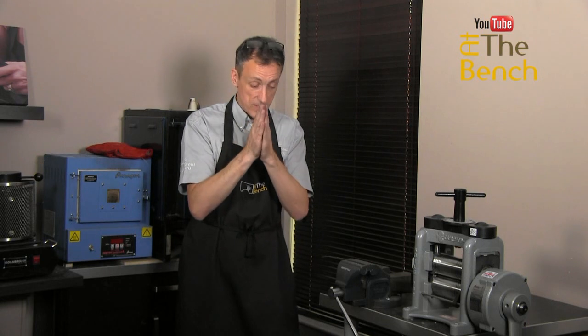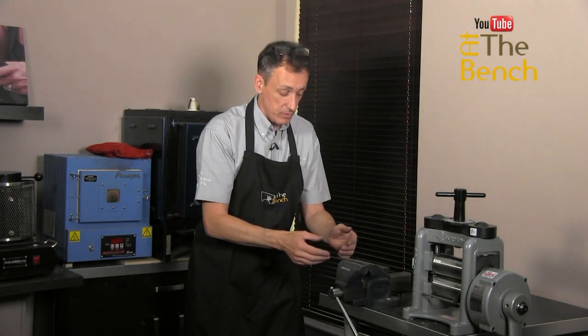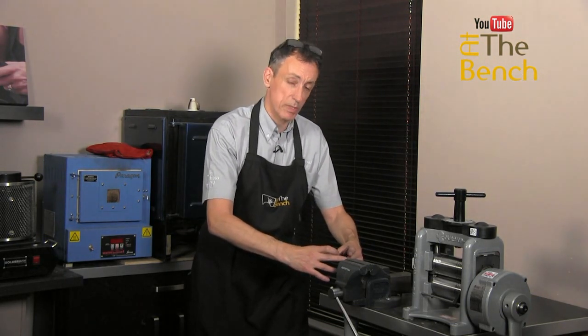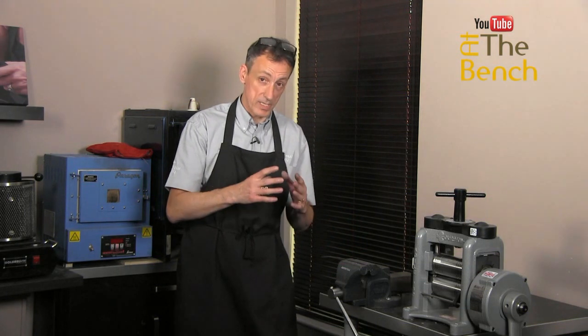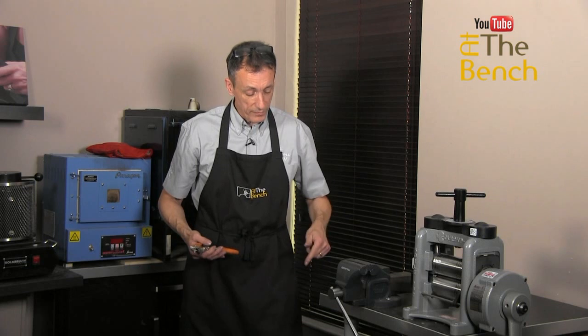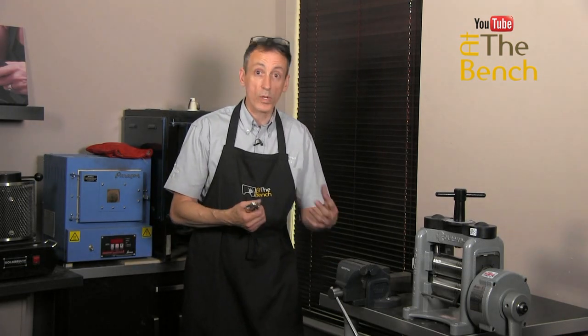and that wire will be die straight. Obviously, we can't use the end or the beginning of the wire because we've damaged it, because we've clamped it, but what you've got in between should be a perfectly straight piece of metal. Fingers crossed, here goes. Bracing myself, I've got one foot in front, one foot behind, because if this wire happens to snap, you don't want to go flying backwards.